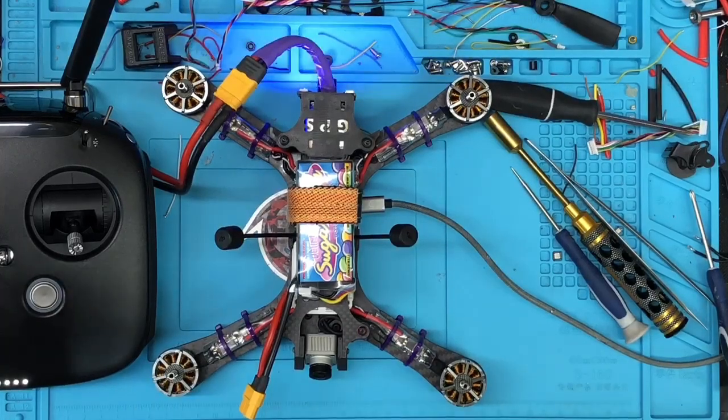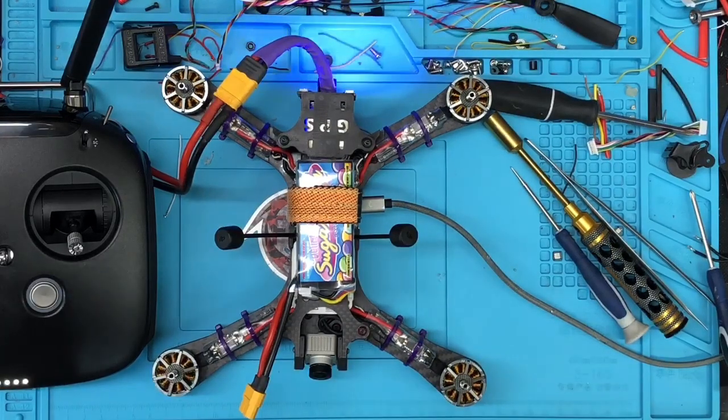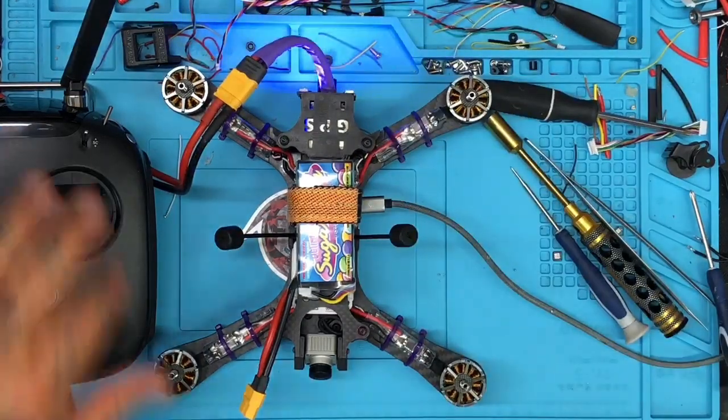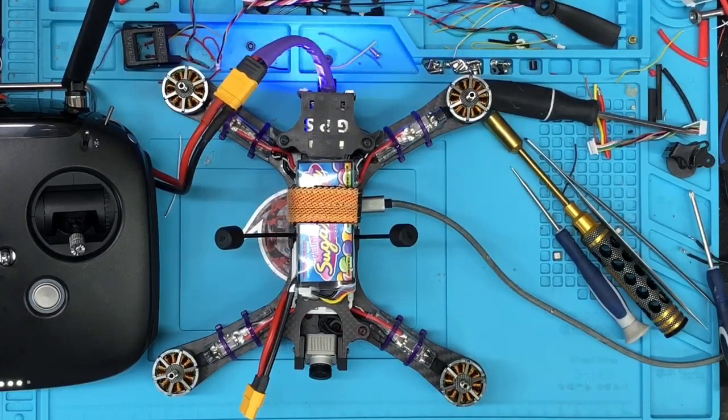That's centered, okay? So then we're going to go to the next one. Oh, you're trimming it centered. Yeah, basically, when the hardware won't get there, you put it there this way. This way the quad doesn't start veering off when the sticks are sitting normal. Got it. Makes sense? And there you go. You're good to go. Now you're at 1,500 on all three. This is golden. Awesome. Yeah, that worked out great. Let's go to motors. Yep. Perfect.